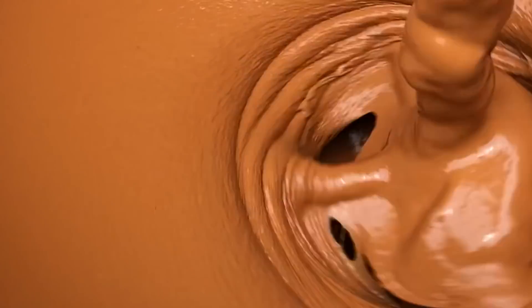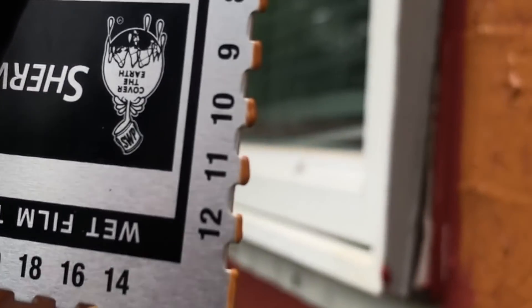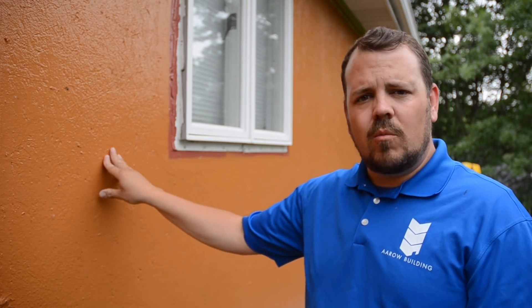After the joints and nail heads are filled and the windows are all prepped, we come back and roll on this Cat5. What we like about this product is if you check it with the mil gauge, everything from that point on is just waterproof. As long as you get it to the mil thickness they ask for — wall to wall, floor to ceiling, corner to corner — it's one monolithic unit that is waterproof. It doesn't matter what cladding we put on after that; no water's getting through. It doesn't matter if the caulking fails or if the siding was installed poorly. And we're not worried about nail penetrations — once you nail through it and leave that nail in, it's not a hole; it's a hole filled with a nail and it won't leak.